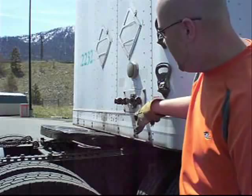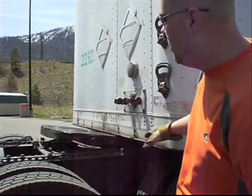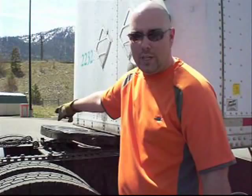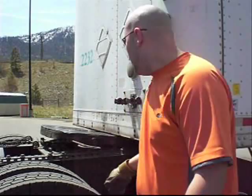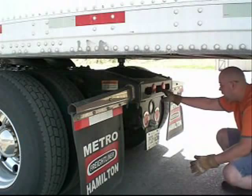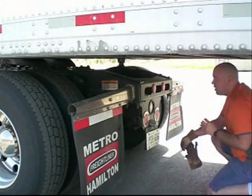The really big last thing you want is to have the trailer too high, ride the kingpin up and over your fifth wheel and get it latched on the other side — that's a bugger to deal with. Before it touches, get out. You want to climb underneath, line yourself up with the pin, and make sure it's going to go right into the slot for the fifth wheel.